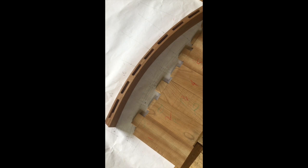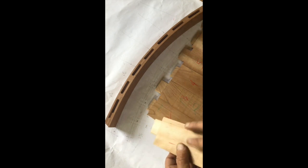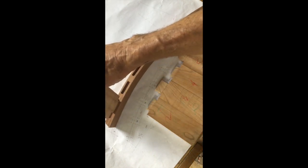So the next step is to mill this to the thickness of the stave, which is roughly about 5/8 of an inch. And then I have to start doing the bevels and various things, which I'll talk about. So here's a mock-up I made, mostly to show you, and also to try to figure out the way this is going to be put together. And I started to fit the different staves. So here's number 1. It goes in. It's got a little bit of a haunch. It gets cut back some, so that fits in. Okay? And on the end of it is a bevel.